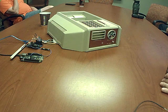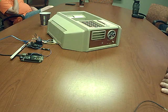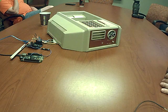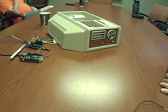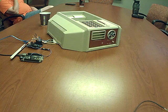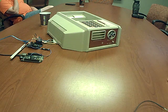When I find an IR sensor that works, it'll be the same for that. And that's the light sensor right there. So if I send the number 3, it'll send back information to the BeagleBone. The BeagleBone's going to just say, hey, I want to know the ambient light. And it's going to go and come right back. The BeagleBone's just going to wait for it to send something back. And so that's the basic code for the Arduino side of things. It's going to change slightly as you add sensors.